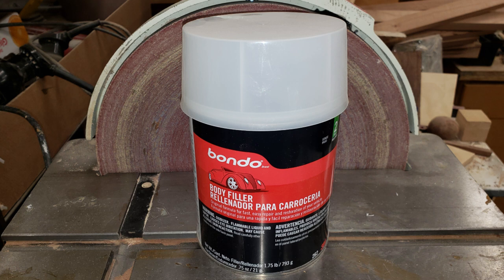The fitting has about 10 complete threads, but we only need up to 5 threads. We will not thread onto all of them when tightening. Use some rice in the fitting cavity to estimate the volume of resin to mix and to temporarily hold everything in place while you determine final sizes for the PVC fitting and the shaft. Pour the rice into a measuring cup to show how much resin you need. Trim the PVC fitting and retest. You can trim the shaft later — just remember to allow for at least 5 complete threads to hold everything together.